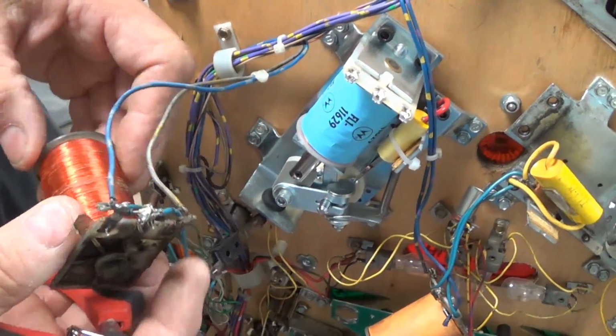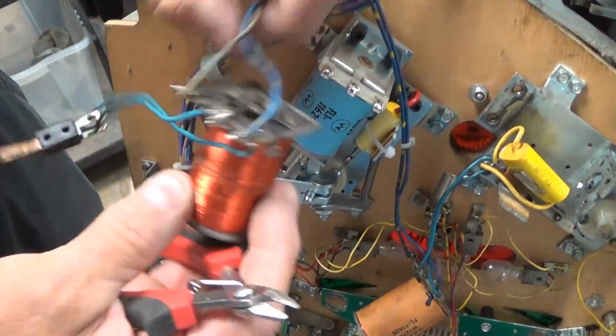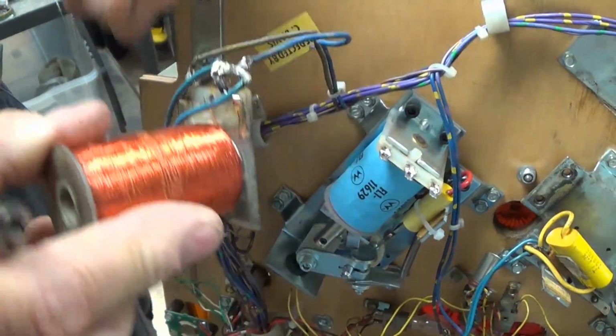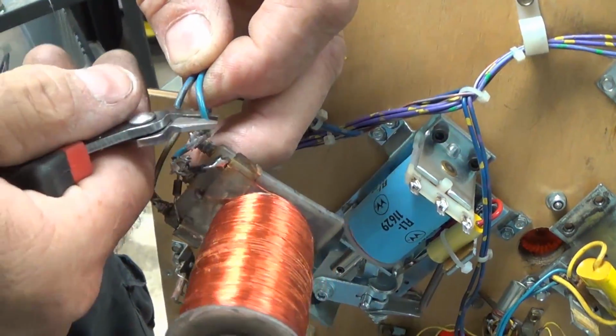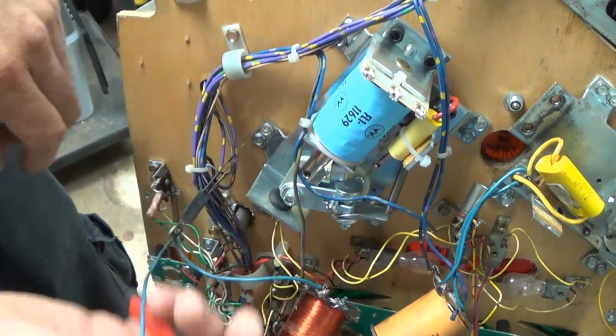We're going to unsolder it and put it back? Right, and then you can keep... No, we're not. No, you cut them. You've got to keep your wire order, or you'll blow a fuse right away, because the diodes only go one direction. So some of them have dual wires on. We'll start with this end, and you cut it off back as close as you can to get all the strand conductors.